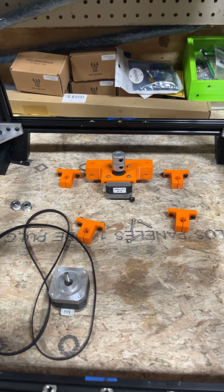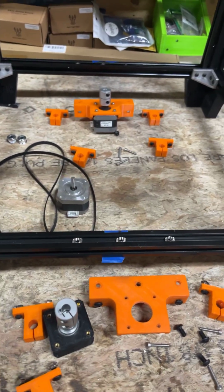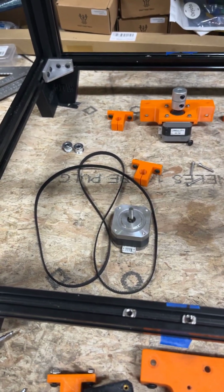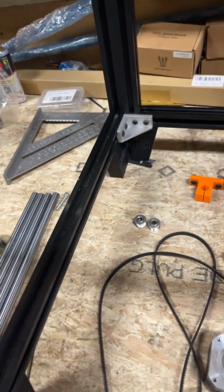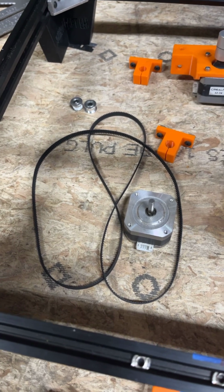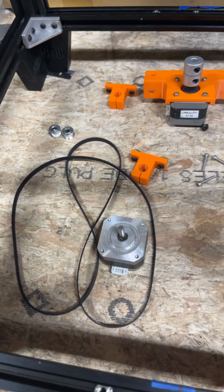In fact, I'll probably set this up the other way and then assemble, just because then I don't have to backtrack a lot. But that basically gives you the idea there. And I'll also explain the belt tensioner when we get to that step, because going this way, the pulleys are going to be up just above these rails, but over in here somewhere. And that's a 1,000 millimeter GT2 6 millimeter loop belt.